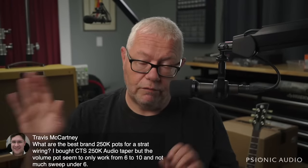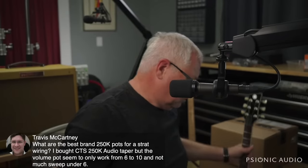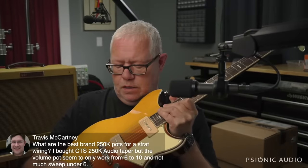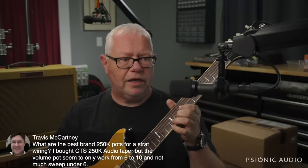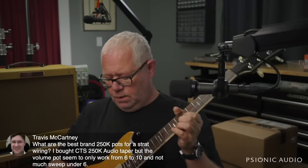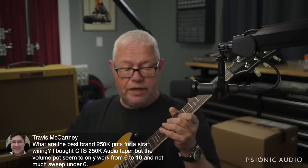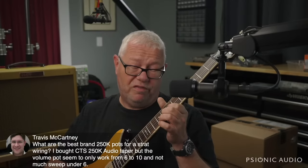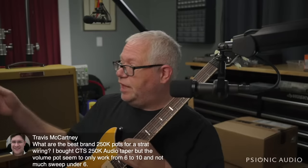Second of all, and I'm going to be showing this in the RevStar video because people have asked questions about this, linear versus audio taper guitar volume pots. Maybe I'll show a little bit right now. So these are 500K audio taper pots. And through this relatively clean amp, it's going to seem like I turn down just a little bit and the volume goes way down. So that's like a quarter turn of the pot. You go halfway down, almost gone, 25% down, 25% up. You're not hearing anything right now. But that's to a low volume clean amp.